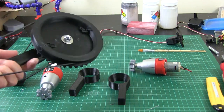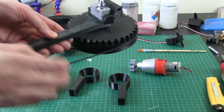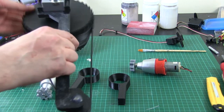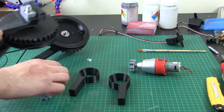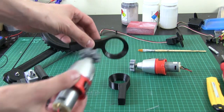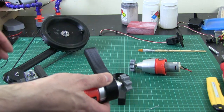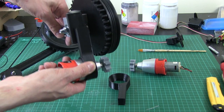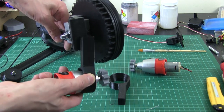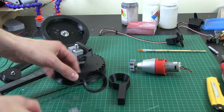I've attached these pieces so we've now got this thing that rotates. What was happening was the cord gets anchored and goes round this small pulley, so as this piece turns — which was motorised by the servo — this cord goes round and that pulls the thing up and down. So what I've now done is made these motor brackets, and they're slightly tapered to match the motor. This is ABS so I can solvent weld this straight in and it will be fixed there forever. This goes across the top here so I can get it in exactly the right position to make sure those gears mesh really well, and I can obviously move it all around just by solvent welding these two surfaces together. Then we can put it all back together hopefully.